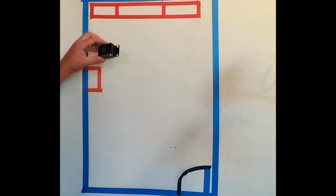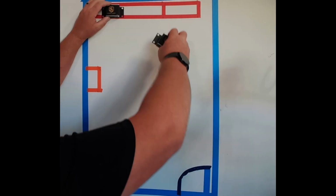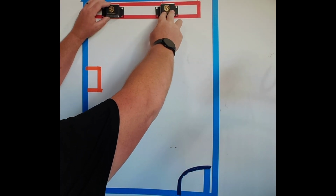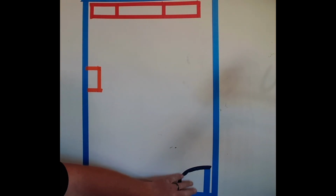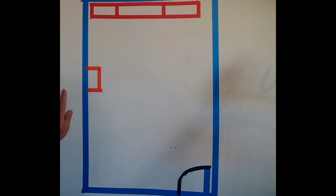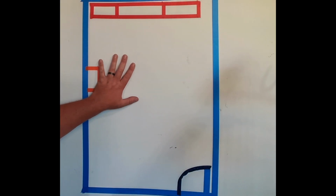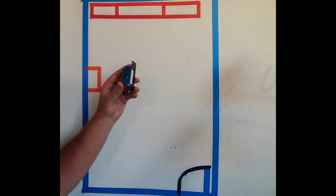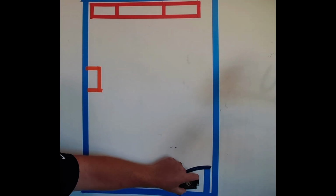So from a design standpoint, we can place one here, one here, and that'll cover our batteries. And seeing as how we only have the one entrance in and out of the room, we're not pulling HVAC from outside in, we're just circulating the air in here. We're going to have one reference sensor to monitor the air quality coming into the room.